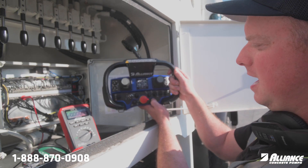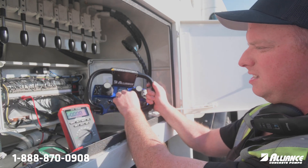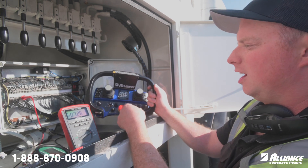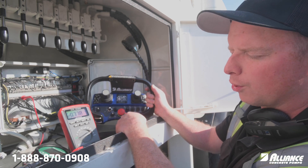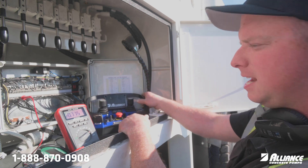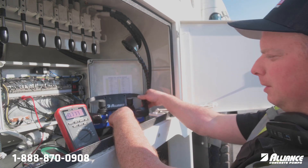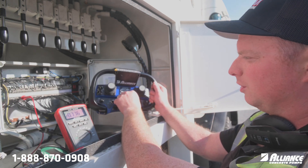We want to be in P002 for programming the current value for the minimum pump speed. We can also go to P003 to program these settings.